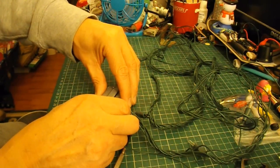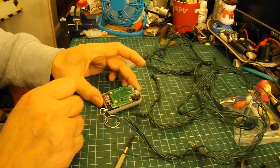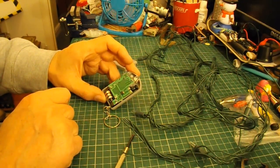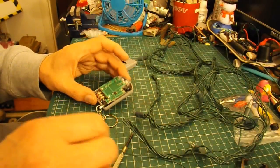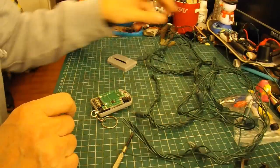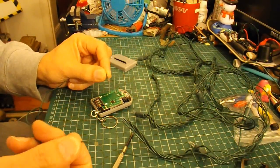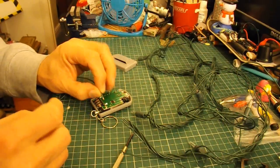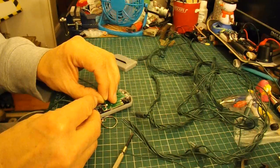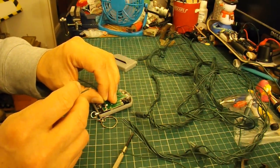It's not like using a meter, it's not accurate, it doesn't give you a reading to tell you whether you've got continuity or not. It just simply sets the alarm off. So all we need to do is attach some wires to these terminals just here. If we have two pieces of wire, one goes to this side and one goes to there, and if there's a short circuit it sets the alarm off.